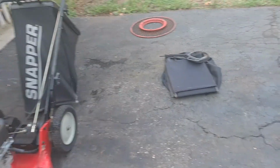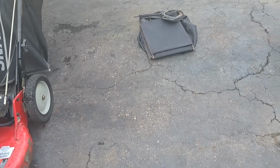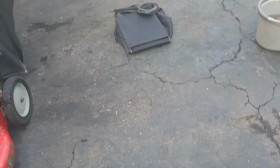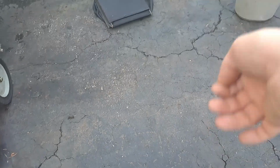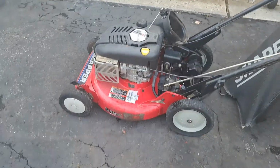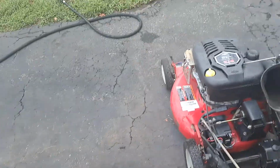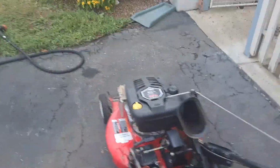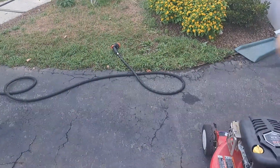Then on that pulley, usually, behind that pulley is that metal plate like that. And then on the dash, you have the handle. That handle, when you let go of it on that old one, or you push it down, one of two ways depending on what machine it is, lets that plate closer to the wheel, because the wheel's on one of them shafts going across. And you have the gear selector up here, and that rubber disc is going across, and when you let that handle down, that plate is brought closer to that rubber disc, and it makes contact, and then it starts moving.